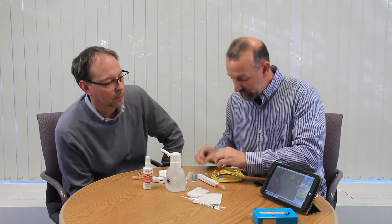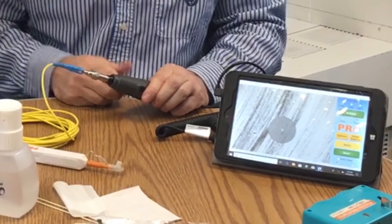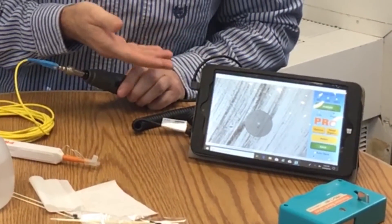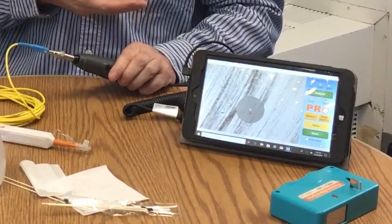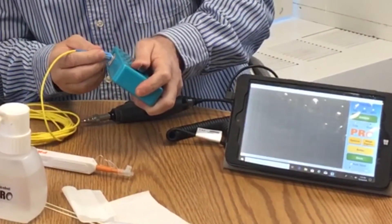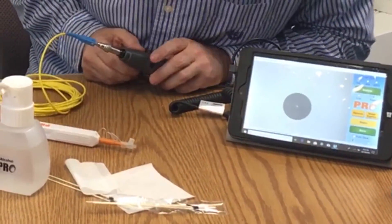So when we're looking at this, we really want to pay close attention to that white dot right in the center, the darker cladding area, and about 250 microns out — you want to make sure it's free of dirt, dust, and contamination. That's called the contact area where the two ferrules would meet. So this one side was good. Now we're going to take a look at the second side. This came out of the bag and we put it in there — wow, what a difference. This side was dirty — that could be oils from hands, moisture, or dirt. We're going to start with our dry method and use the cassette, which I do prefer. We open it up and draw in one direction. And we'll insert again — wow, you can see how clean that was. That's amazing.